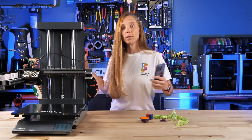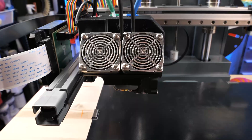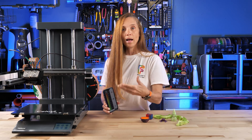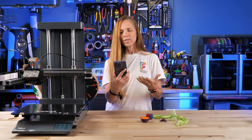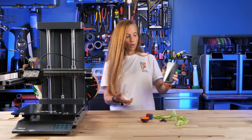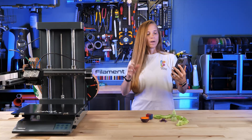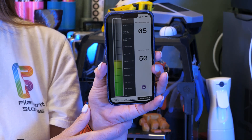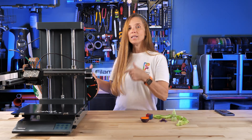Anytime I have a printer I'm interested to know what the decibel levels are and how loud it is since we are around 3D printers a lot. This one has two big fans cooling the extruder that has two filaments coming out at the same time, so it's got a lot of cooling power. Right near the printer it's over 70 dB, which is considered disruptive. A little further away it drops to around 60, which is laundry level, and one step further back we're down to 50, which is conversational level.